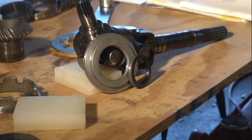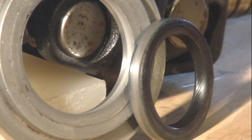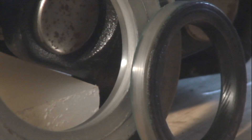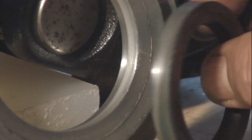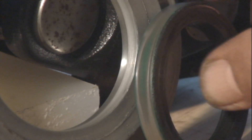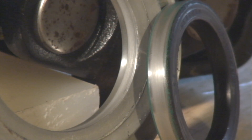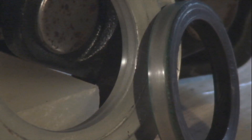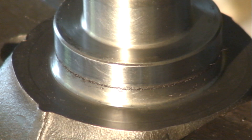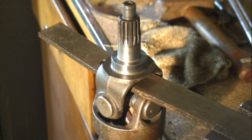If that aluminum carrier is ruined, it can be bought separately and replaced. It looks to me like that seal has even spun in there a little bit and shifted at an angle in its position. That seal probably shifted in there during a pressure test, and that happened because the installer didn't use any Loctite. A more typical driveshaft seal failure is caused by corrosion and pitting on the face where the seal rides on the yoke. This type of failure can be accelerated by having water in the bellows.